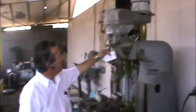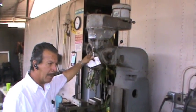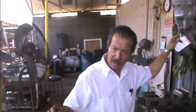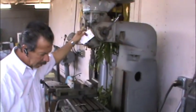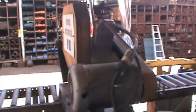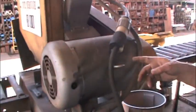This milling machine requires 7 amps. So 7 amps and 38 amps — I've got 45 amps needed for these two machines. I've got 50 amps over here, so I'm right on the spot with those two at max load. I can run these two machines at the same time. And a small chop saw doesn't pull out so many amps.